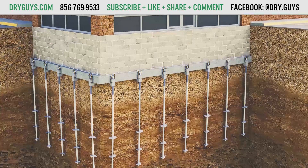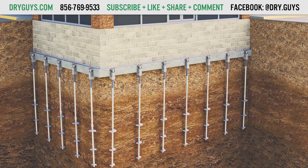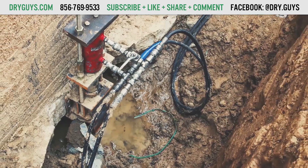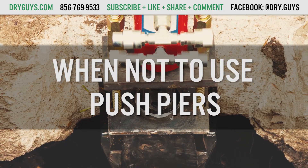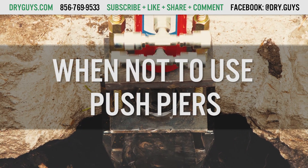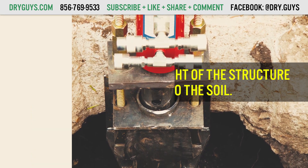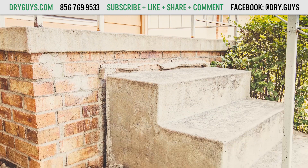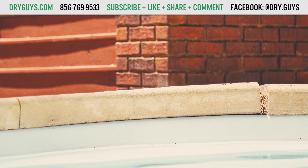This is one of the differences between push piers and helical piers, since helical piers do require an intimate knowledge of the local soil, but push piers don't while providing the same solution. Unlike helical piers, push piers do require the weight of the structure to help drive them into the soil. So if you want to lift a lighter structure like a chimney, stairs, or a deck, these might not be heavy enough to drive the push piers to a sufficient depth.